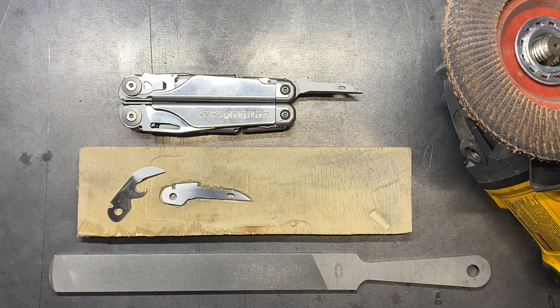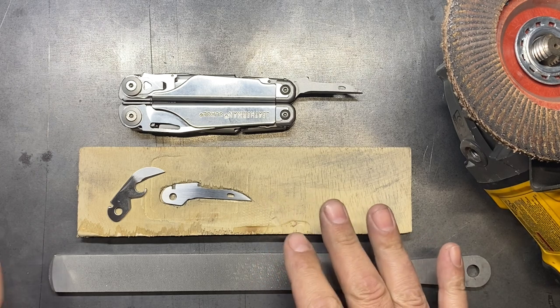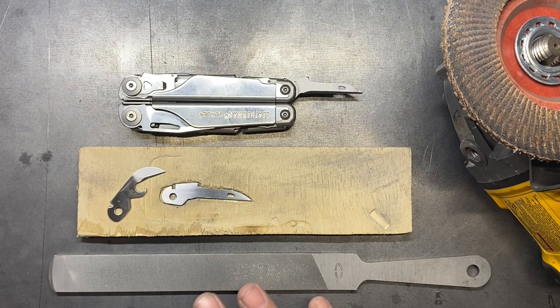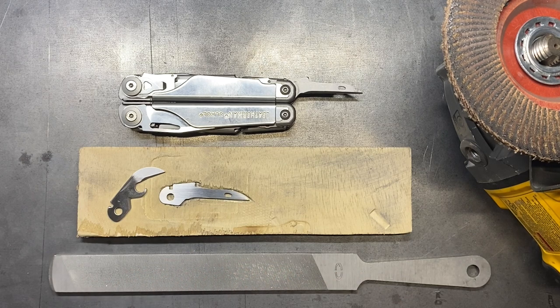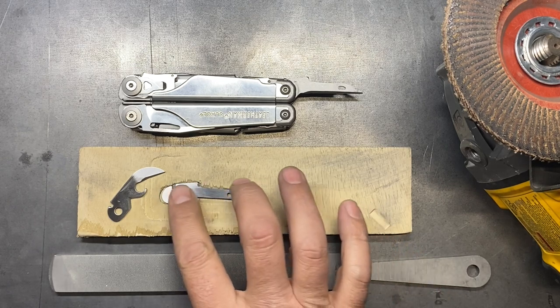I wanted a real smooth transition and it worked out really, really well. I also ended up using this block here. When I went into the sanding process, I was able to flip this around and use it against the emery cloth. I was able to get a lot of pressure on it by doing it that way and it made the sanding a lot easier. Once I profiled it to where I wanted it, I first went over the file probably about a dozen different times just to knock off the high spots first. Then we went into 150 grit emery cloth and then on to 220 emery cloth, and it really worked out well.